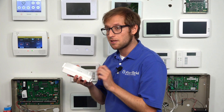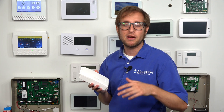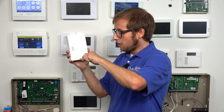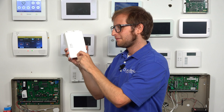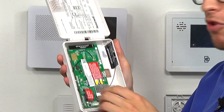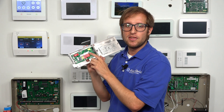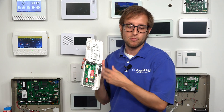Today we're using a Honeywell LTE-XA — this is the AT&T model. The Verizon one looks pretty much the same. Go with whichever cellular network provides better coverage in your area; check coverage maps if you aren't sure. We want to make sure we note the MAC and CRC codes on the communicator, as you will need those when you go to activate. It's recommended that you either write down these codes or take a picture of the sticker so you have easy access later and won't have to reopen the module.